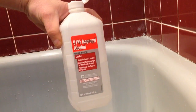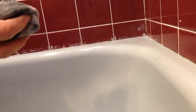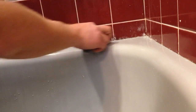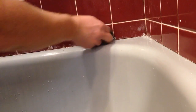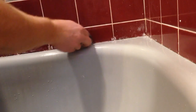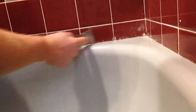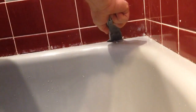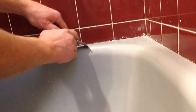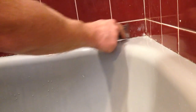So I'll go ahead and get my alcohol, and I'm going to put a little bit on there, and I'll rub it around the area that I just scraped just to see what's left and see where I need to scrape. Once I get that little section done there, it looks pretty clean. So I'm going to continue scraping the rest of the area around the tub, and this takes some time, but it's very important to get all the old caulking out so your new caulking has a nice, good surface to adhere to.